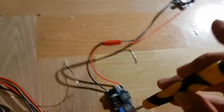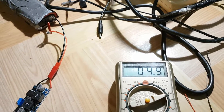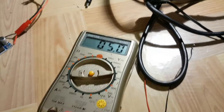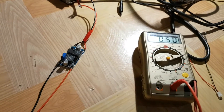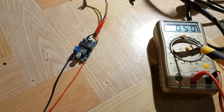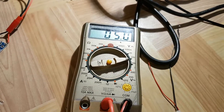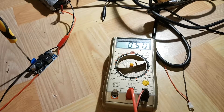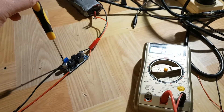I have this set on 5 volts now, and this is currently outputting 12 volts on the second module. I'm going to reduce the input voltage by turning the potentiometer on the first module. As I'm spinning the screwdriver, you'll notice the voltage coming out of this thing is 100% stable, which is really really impressive. I'm going to keep turning this until it cuts out.